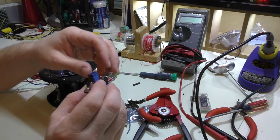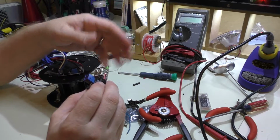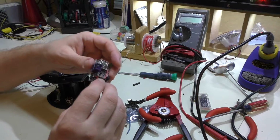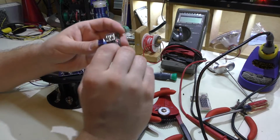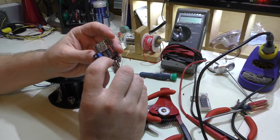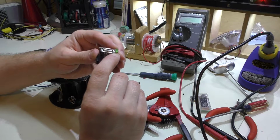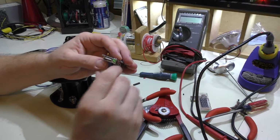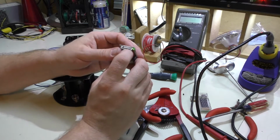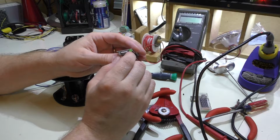they're connected together, because a lot of devices, when they're connected, they want to draw the maximum amount of current available, and this acts kind of like a cheater circuit, I guess you could say. But one of the other things it does is it adds a little USB port, obviously with a LED light next to it, and that way if I plug it into something, I can test the output of it right away and see if it's working without having to plug anything else into it.